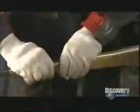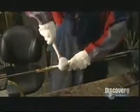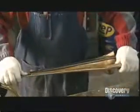To make a trombone, they cut sheet brass in the pattern of a bell stem. They shape it by wrapping it around a steel rod. Using a nylon-headed mallet, the worker hammers the brass to shape it further. It takes just a few minutes for him to hammer out a rough bell stem form. He spreads open the stem slightly so he can make small notches on one edge with snippers.